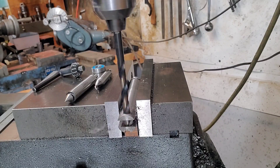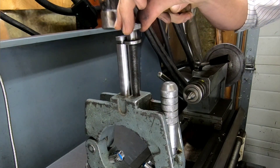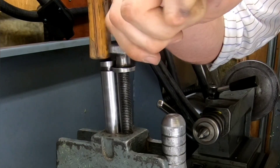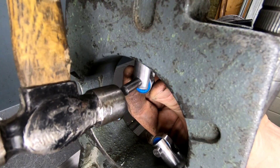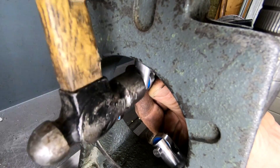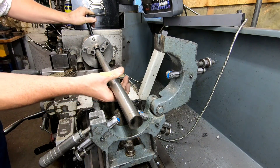Now that we got all the confusing science out of the way, let's clean these parts up and take them over to the lathe and dry fit them all up. Everything fit together just amazingly. I am tapping it with a hammer there, but I had to incrementally move it as I threaded it down, just so I didn't cross thread it. It was just a page out of Goldilocks — either pushing too hard or too light, and you just wanted to ride in the middle. It sure is coming together and looking pretty good — all of these fits are fitting perfect. I had a bit of a chamfer on one end and on the other side I actually left the burr there. I think the press fit is going to be more than enough to hold them in, but I'm going to keep an eye on it and might have to peen those a little later on.